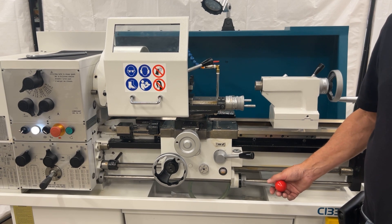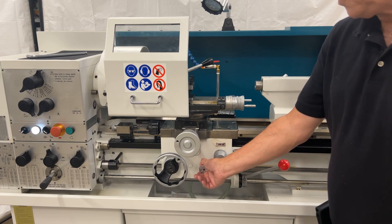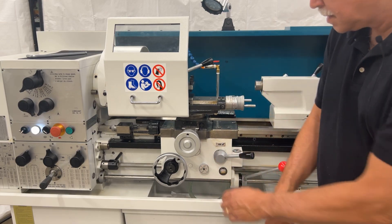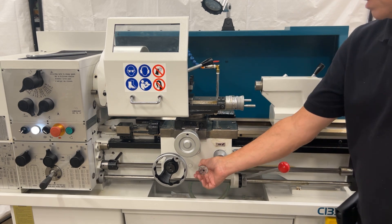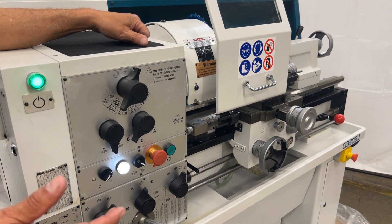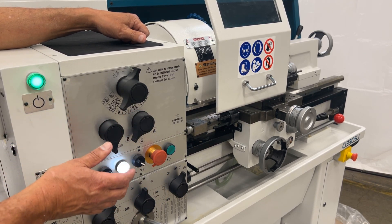In order to start the machine, lift up on the set lever. Engage feeding for cross feed. Push in on the top to engage for longitudinal feeding. The headstock on the J Series is also clutched for threading and for direction of carriage.